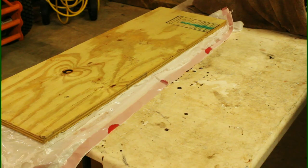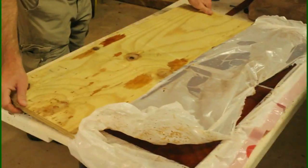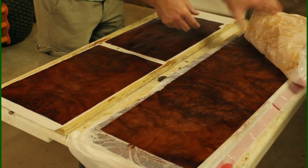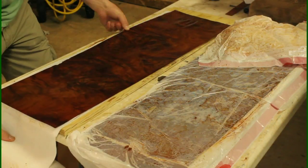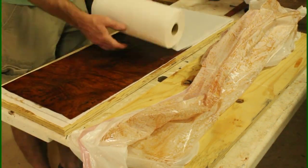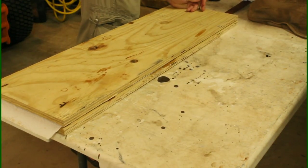It's been an hour. I'm going to go ahead and remove it — you're going to see they are nice and flat already. That veneer softener has worked its way into them and they're very pliable and soft now. We're going to layer the paper towels between each layer of veneer and begin removing the veneer softener back out of the wood.